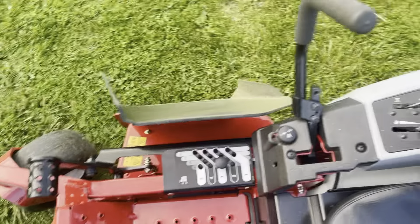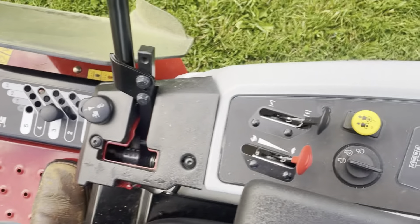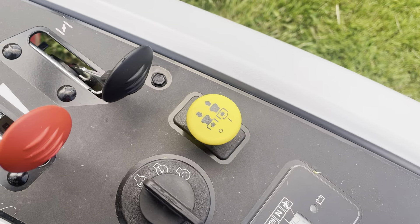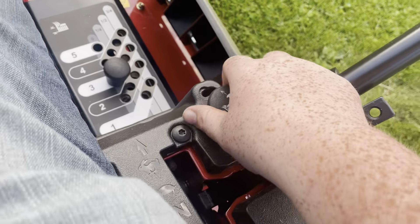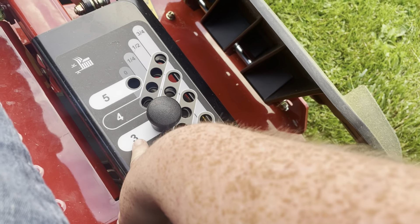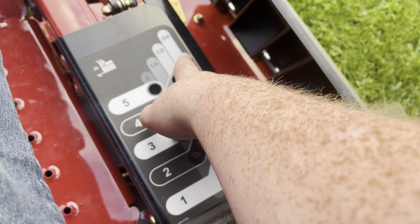When you sit on the mower, you got your seat. It has a suspension seat option but I didn't get it — extra seven hundred dollars I didn't have. You got your seat belt right here. Then you get your control panel, which has your hour meter — just at three hours — your PTO engagement, your choke, your throttle, and down here you got your deck locking lever: pull that up and it drops the deck, push it back and it locks it. If you want to float it, you put it up there and float it however you want, then put it back when you're done.